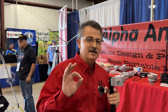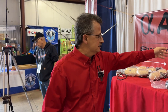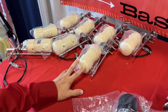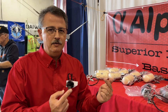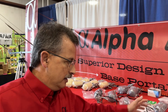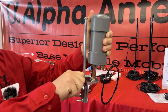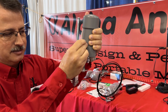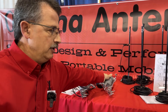We have the HOA Buster, which is a 10-through-80-meter antenna that needs no tuner. It comes in many different colors for matching your home's exterior. This antenna will activate your largest antenna, which is your gutters — more wire in the air is more better, as my Elmer used to say. I created this antenna out of my own needs: a spike that goes into the ground, a clip that attaches to the downspout, and you're done. That's 10 to 80 meters without a tuner because the inductor matches the capacitance of the gutters once you attach the coax.